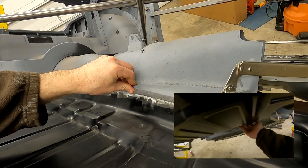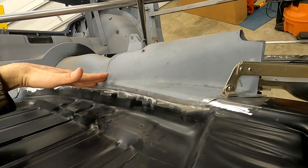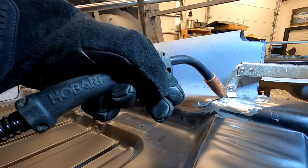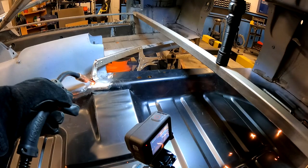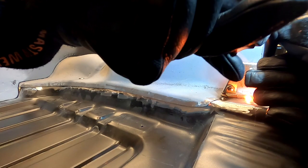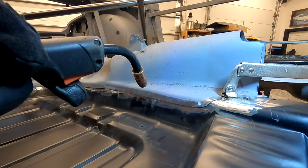So what I'm going to do is come in with the welder, and I'm just going to tack, tack, and then I'm going to move clamps, and I'm going to reach behind. So imagine this hand is up underneath, which I'll see if I can show you with the other camera. I'm going to come along as I tack this. I'll move myself in and either push up or use a hammer end and push together and basically sandwich these. The whole idea, we'll leave tacks every couple inches and bring this all together nice and tight. So that's the theory. Let's try it out.